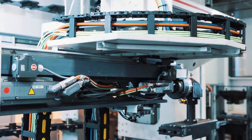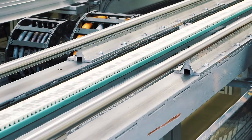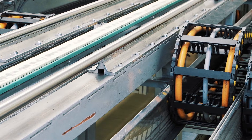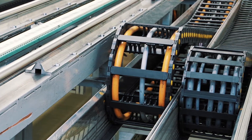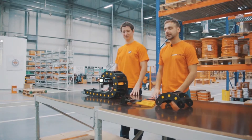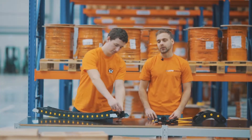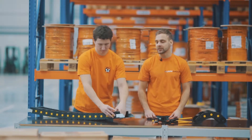This can be seen on almost any machine shop floor. This growing acceptance is due to the extensive testing that has demonstrated the longevity of these cable chains, which has also convinced engineers of the suitability of plastic for a wide range of applications. Today, for this purpose, we will use this plastic chain. It is the 445 model, medium series, with inner dimensions of 45 mm in height and 163 mm in width.